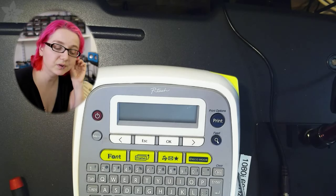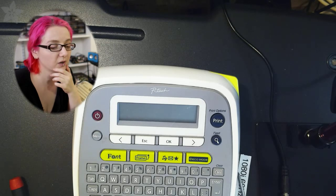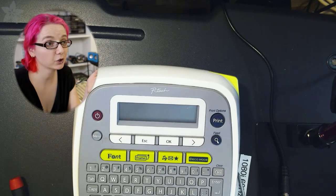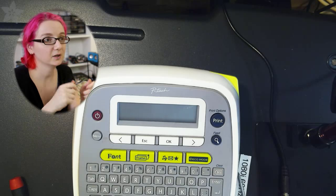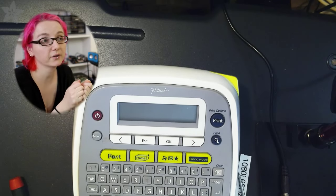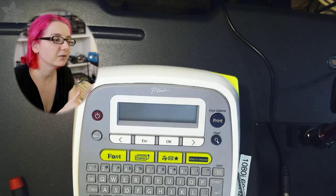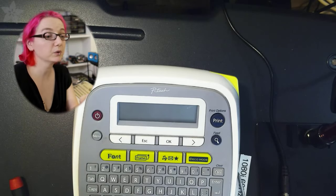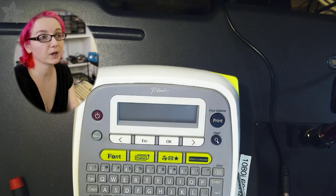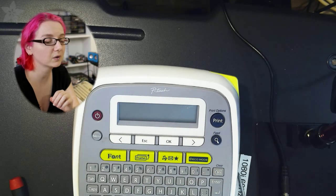For PTC fuses, if the PTC fuse breaks or is open, it's probably because something inside was damaged. So you can check. There could be a loose wire, and that wire bridged something, or some connector got loose, and that's what caused the short. So you want to fix that first. It depends on each item. Like for this one, when I opened it, I looked around a little bit, and there was that battery corrosion. Maybe you'd look, did that battery acid go in and damage something on a circuit board or cause something to short? So check that out.